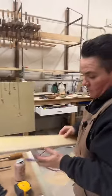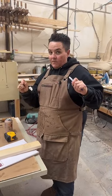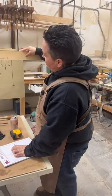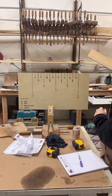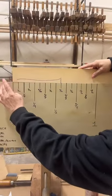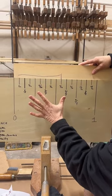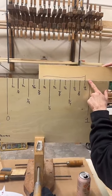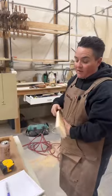All you have to do is whatever you're subtracting or adding, measure it out. Then you can put it on your tape measure and go, oh, that's what it is. No math involved. No converting fractions, nothing. I wanted to know what 9 sixteenths subtracted from 15 sixteenths was. So I placed my board on zero, and I made a mark at 9 sixteenths. This is not true to scale, but this is supposed to be 9 sixteenths, right? We were subtracting that from 15 sixteenths. Put that on the 15, goes right to 3 eighths. There's your answer. No math, just marking.